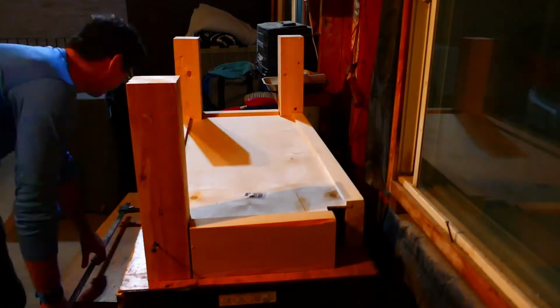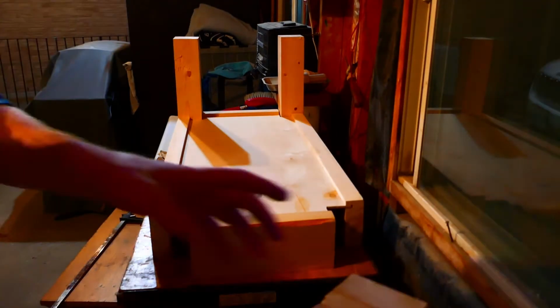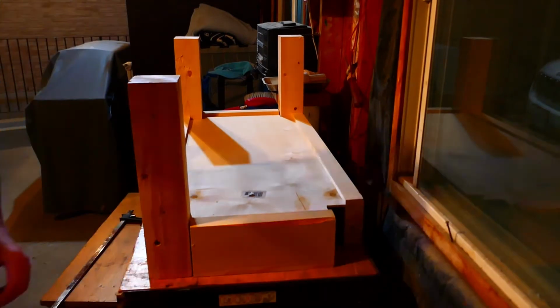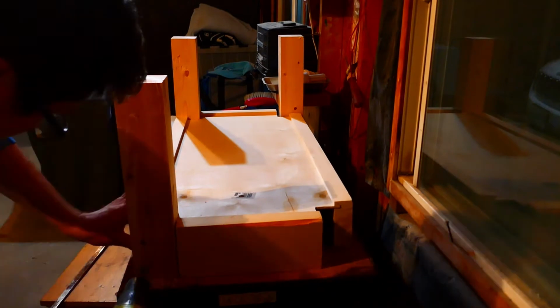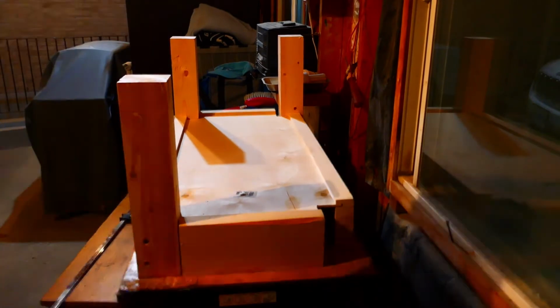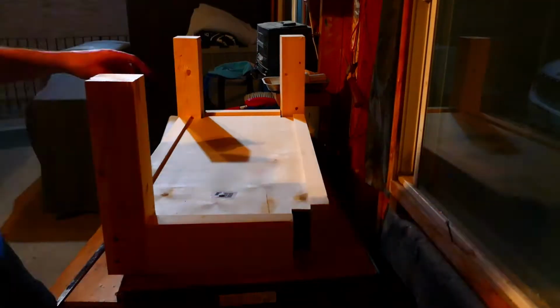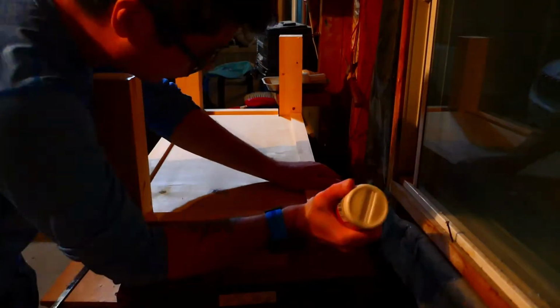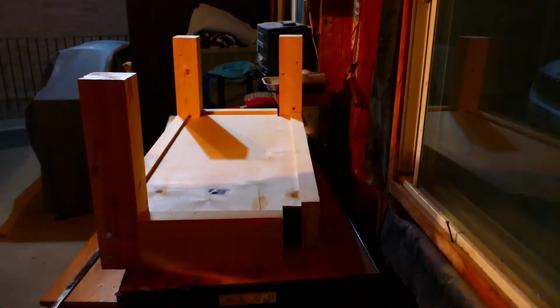The glue up went surprisingly well. I used the flattest surface I had, the top of a tool chest. I assembled the skirt and the legs upside down, that way the top of the legs and the skirt would be completely flush. I first drilled 3/8 holes that were about 1 inch deep, this way the screw would penetrate at least 1 inch into the skirt. Then I put some glue on the joints and used 3" wood screws to hold everything together, checking to make sure everything was square along the way.